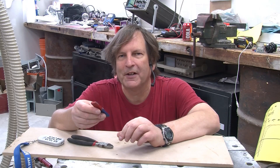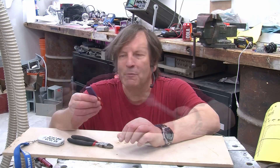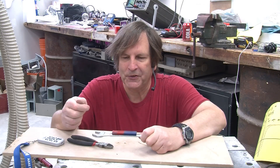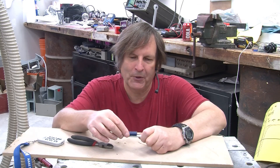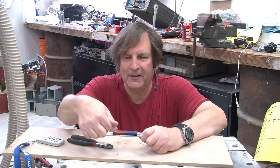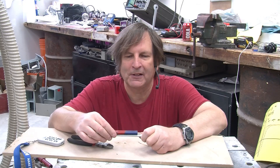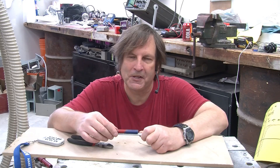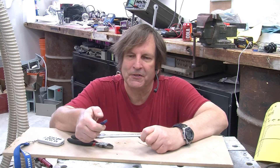You can often have it happen that when you have a nice magnet at home and you drop it, it suddenly isn't much of a magnet anymore. One of the ways to prevent that sort of thing from happening is to use a keeper — in this case, this wrench. By putting the magnet on the wrench, we're actually creating a magnetic circuit that makes it easier for the magnetic flux to flow from one end of the magnet to the other, and in turn makes it a little bit harder for the magnet to get demagnetized. In a lot of cases, particularly if you have a horseshoe magnet, you are given a keeper with the magnet. But because it is damaging to the magnet, this is really not a good way to demagnetize something.